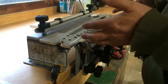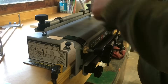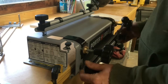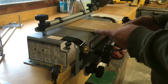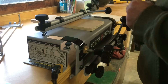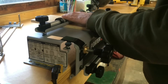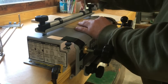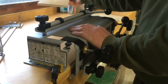I'm back at the jig and I want to set the preload for the clamps in back and the clamp on the front. I'm going to loosen everything up — the offset guides and offset stops are all loosened and out of the way. I set a work piece in there with the handle all the way forward so the clamp is all the way up. I spin these down until they just barely touch, barely dragging. Now when I engage the cams, that's what's going to lock my piece in, but when I disengage, my pieces are going to slide in and out easily.